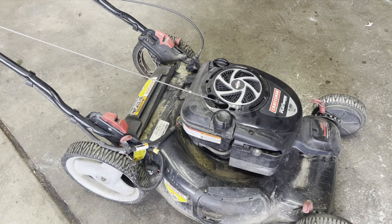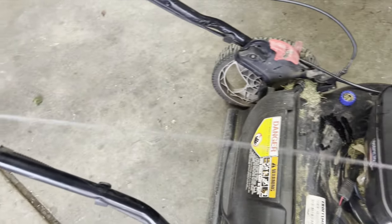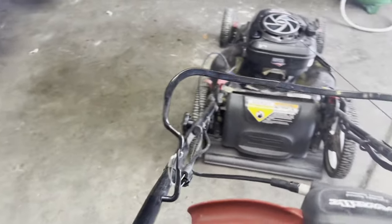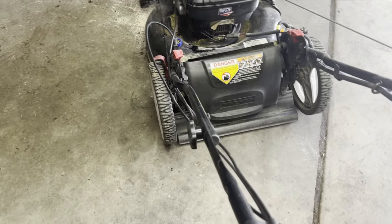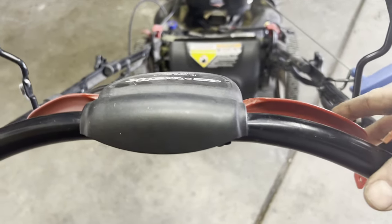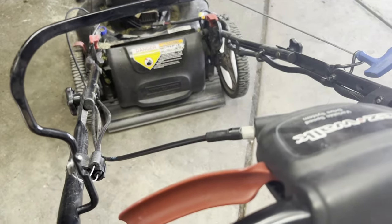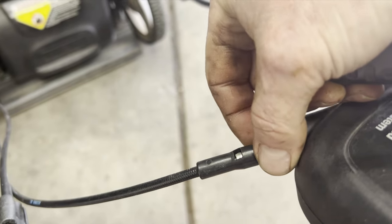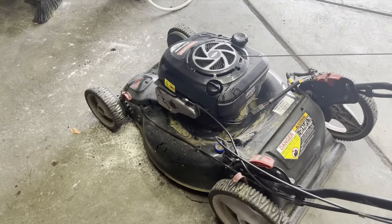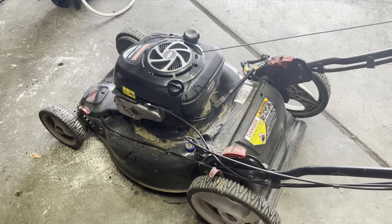While waiting on that blade, inspect the pull cord to make sure it's not fraying or about to break — this one looks pretty good. Make sure all the cables are working and moving, and they are. Once it's running, we'll check the EasyWalk feature by pulling the handles and making sure it's adjusted correctly. There's an adjuster right here so you can make an adjustment. That's it — thanks for watching, put any questions or comments down below.